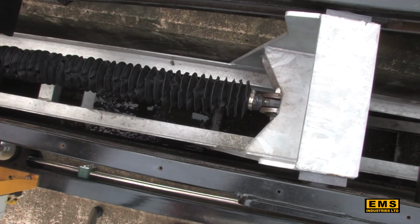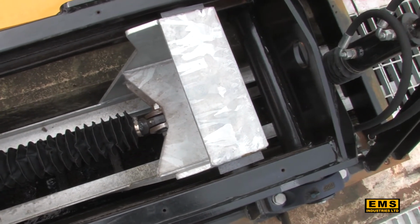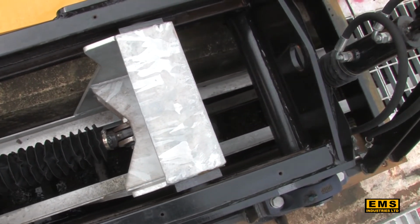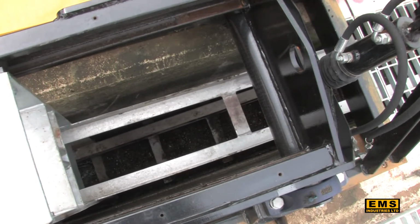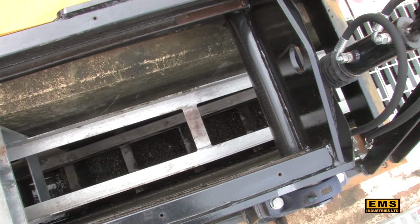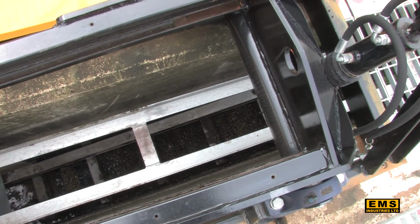As with the traditional grit rake, the grit is allowed to tumble back and forth as the rake cycles to endeavour to remove the organics. The action of the Hydrake slowly pushes the grit forward, clear of the waterline, to allow it to drain and subsequently discharge into a skip.